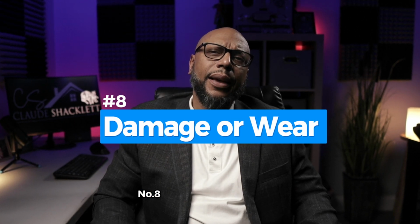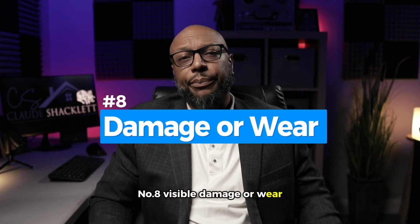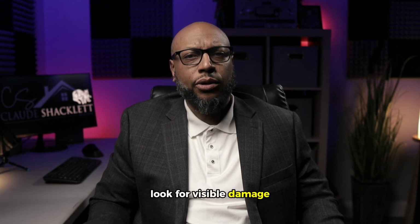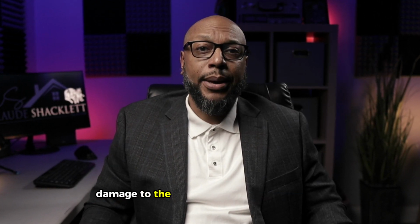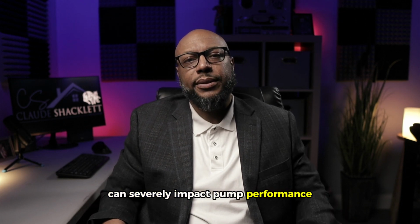Number 8, visible damage or wear. Look for visible damage, cracks, or wear on the pump and its components. Damage to the impeller, a crucial component, can severely impact pump performance.